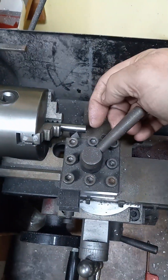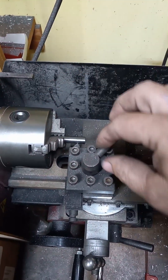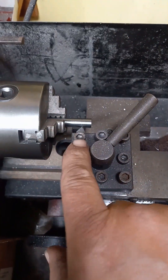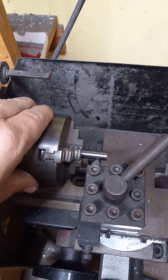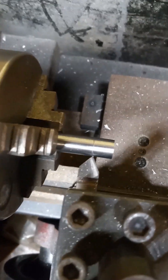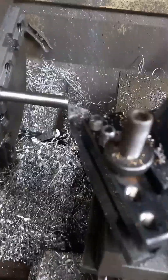It hits the back and is sticking out. So what I do is I stick in my measuring pushrod, move the blade where I need it, line the blade up, and then stick each pushrod in there. I just spin it by hand because I'm not trying to cut with this lathe — that's too wimpy — and then I use the blade to mark it. You can see my little marking line. Then I come over to my big lathe here and actually cut it.